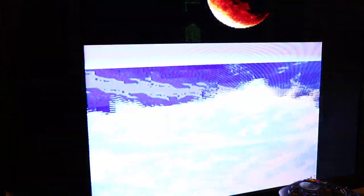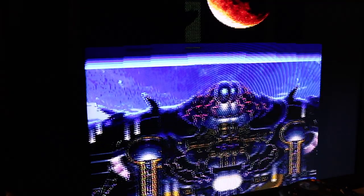I've been running this for several hours now, and we haven't had any problems, except for the green line. Look at how clear those graphics are. Everything else seems to be working fine. So it is more or less cosmetic, so it's not a showstopper, unlike the other Super Nintendo I did, the Madden one, where it needed trace repair.